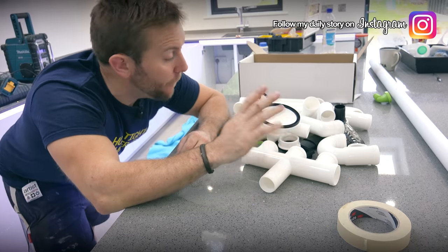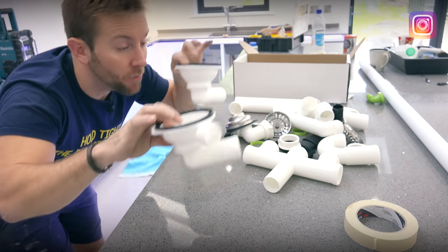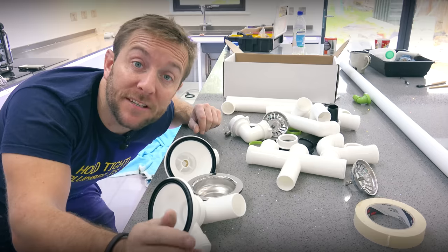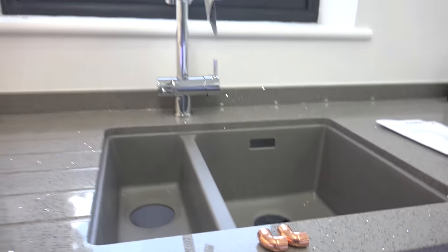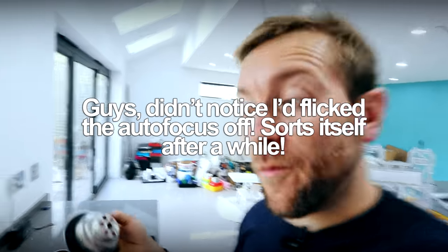The first thing I'd do is just get the obvious bits and bobs out of the way. Pick up your two bowl bits, pick up the two bowl clamps, find the actual screw bits for them as well, and get them attached first on your basin. Let's do that really quickly now. Let's face it, all kitchen sinks are different, all of their waste systems are different as well. So I'm not going to give you the 100% way of doing it on your kitchen sink, but I am going to give you a quick overview of how to do it normally.